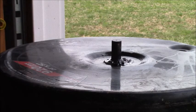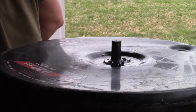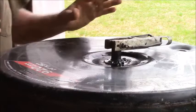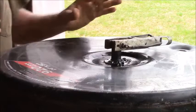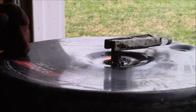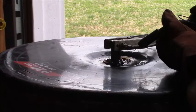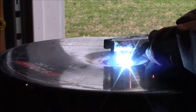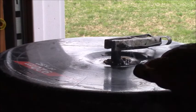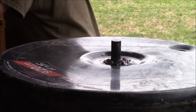Two small pinholes to weld up — I ground off the paint already. I'll do this side first. This one was just a tiny, tiny leak over here. Alright, I'm calling it done because those were the only two leaks I found on the second test. Let that cool just a minute and I'll hit it with some paint.